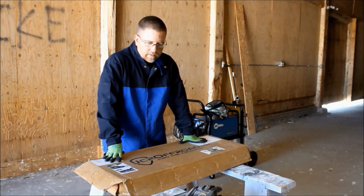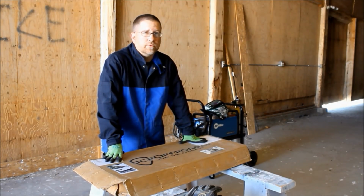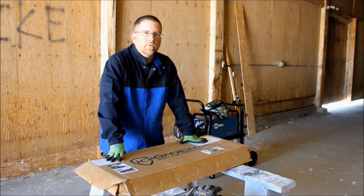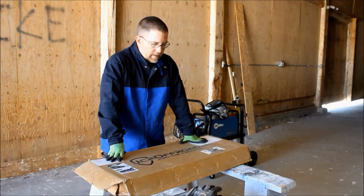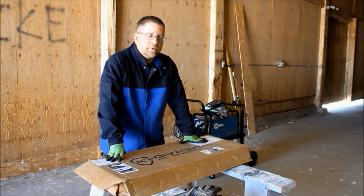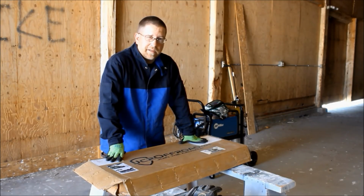This is a really great starter project for a couple of reasons. Number one being that the metal's really thick, and thick metal is a lot more forgiving when you're learning how to weld. And the second thing is you can grind and paint over this. So if your welds turn out crappy in the beginning, you're going to be able to grind them out and paint over them. As Abe likes to say, the grinder and paint make me the welder I ain't.